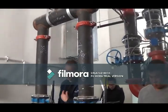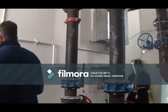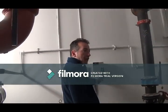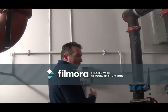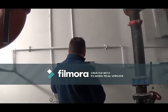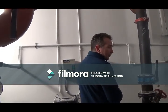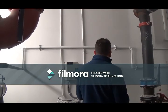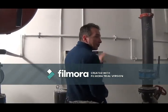I don't know. Our chiller's just going to send out a signal. The way they may have this is, if they're both in auto and one turns off, maybe this one comes on automatically. Right? And then you can put that back on. I don't know how they have it set up on here, but the pump should only operate when the chiller's operating. So that's something we'll have to see. Is it a manual switchover, or is it one of those where this is always going to be the lead?